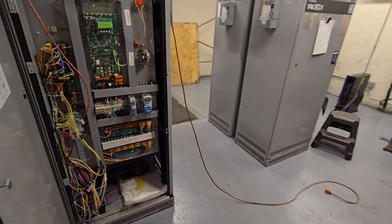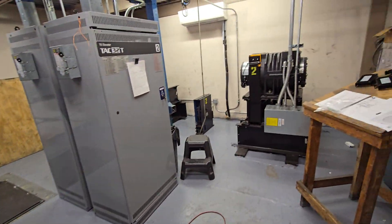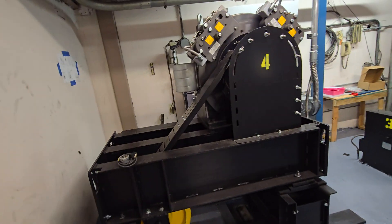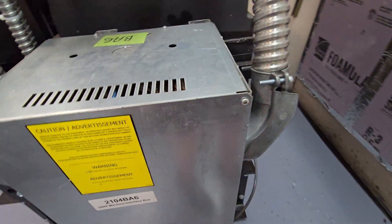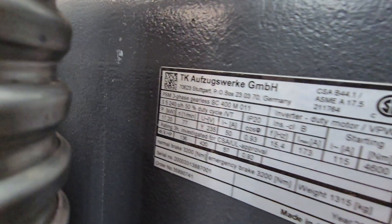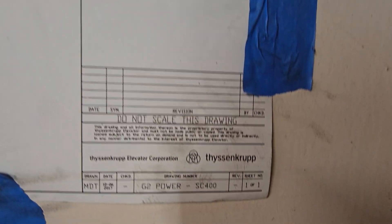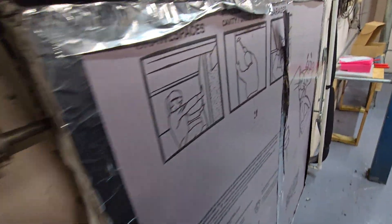This one has a higher capacity as well — a larger motor. I wish they used all TK motors on these. The touring machines — I've seen so many pictures of them all torn apart, needing major motor work. These were 2198T machines; you could let those things run 100 years. I've seen series 70 machines over 100 years old. 30 horsepower. You can see inside the motor — the windings. These are made in Germany. You can see your diagrams for it.